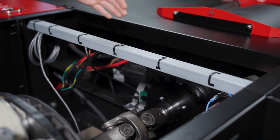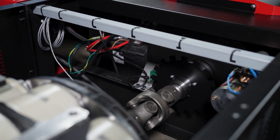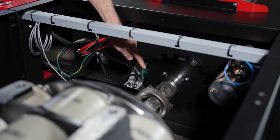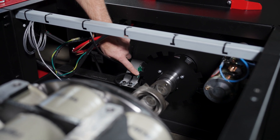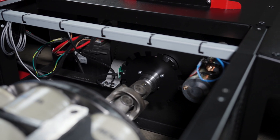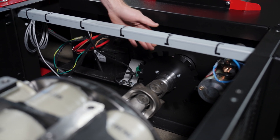Right next to the battery is our speed pickup card. Make sure this cable stays tight and your pickup card is properly aligned before use. If you're a new operator, double-check the condition of your dyno. We include an alignment jig that goes between the optical pickup and the pickup disc to ensure it's in the right position both left-right and forward-backward, so you don't damage the card or have the pickup wheel run into it.